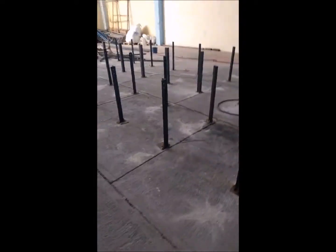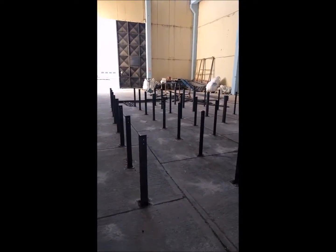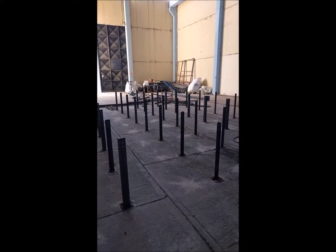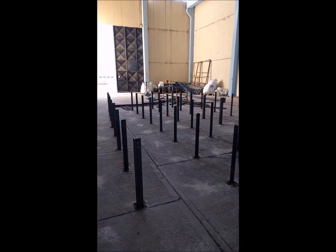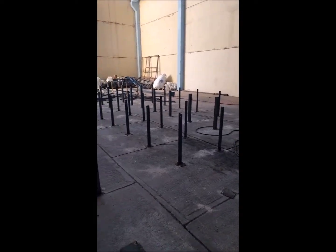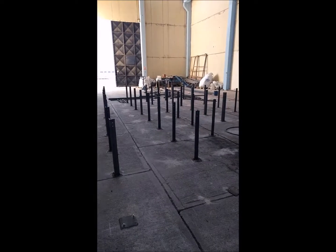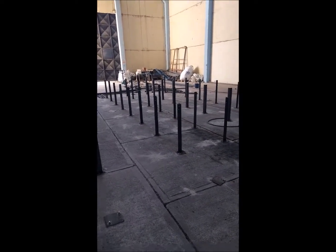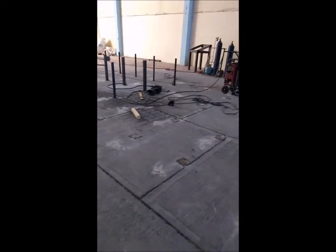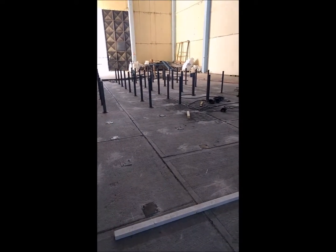on lengthways. The frames are what goes transverse across the boat, or sideways, or athwartships, or whatever you want to call it. We'll normally refer to them as transverse, and then longitudinally running the length of the boat are stringers that slot and lock into the frame. So this is all of the preparation, getting ready for the aluminum frame that's going to create kind of like a tabletop. It won't be solid, but all of the pieces will be in the right places to have the aluminum frame pieces tacked in place once they're precisely measured and in just the right spot.